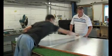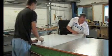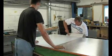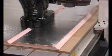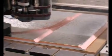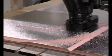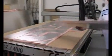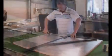Weatherproofing tape can also be applied to the phenolic foam prior to cutting. Again, this dramatically reduces time during the fabrication process. The accuracy of the Axyz router ensures the surface is cut precisely and no ripping or removal of the tape occurs. A completely finished part, fully weatherproofed, is produced quickly and accurately, and very little fabrication is needed.